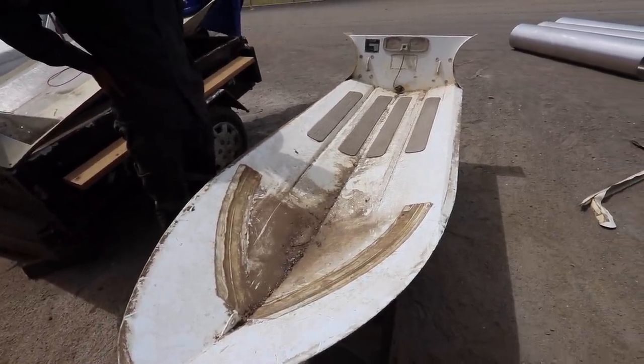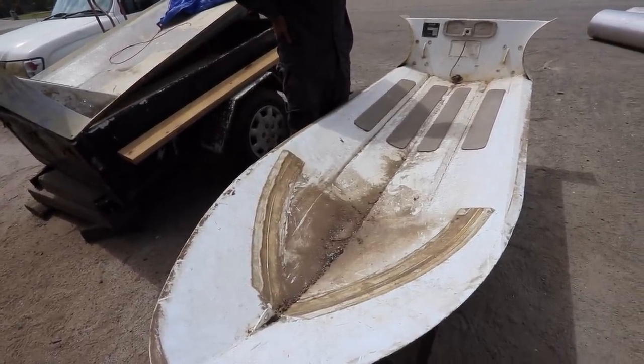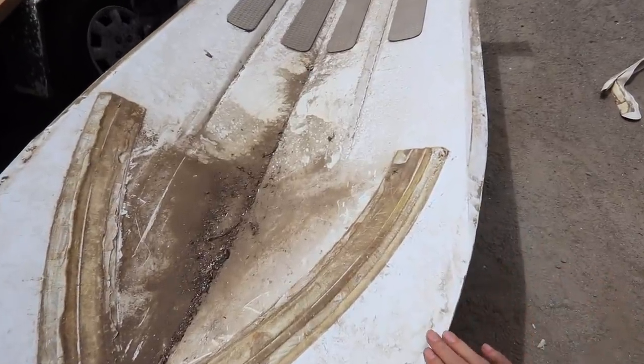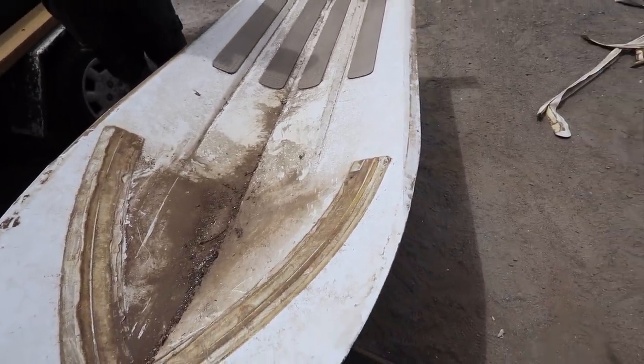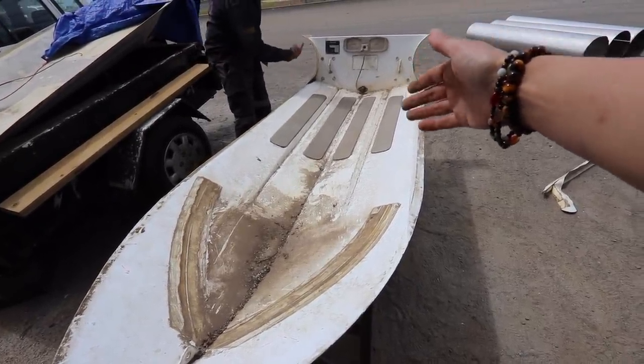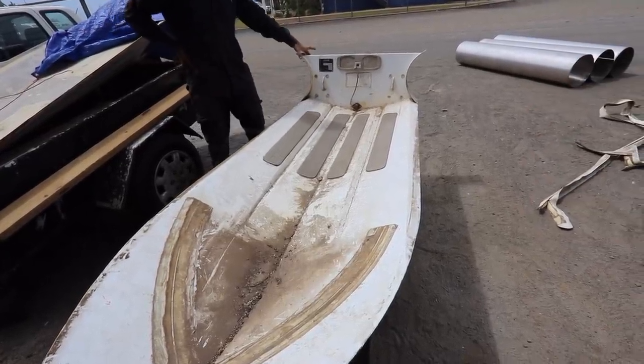Figure out how big the tubes are, eh? Why don't we size them now? Yeah. And then we'll start taking off the edges. So we've got to sand. Yeah, so we'll buzz the edge back. And you're going to do the rolls. So we've got to make the tube that diameter, so we have to figure out what that diameter is. But you'll be welding to that, so we've got to tidy that up. Take the paint off there.